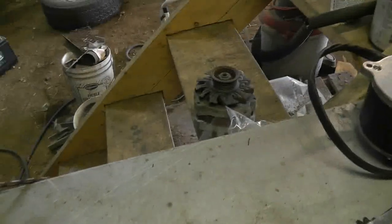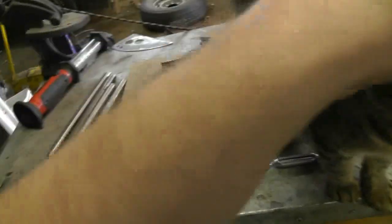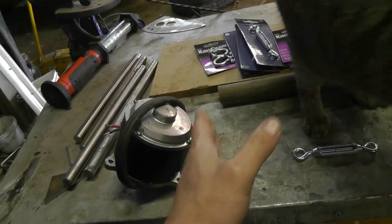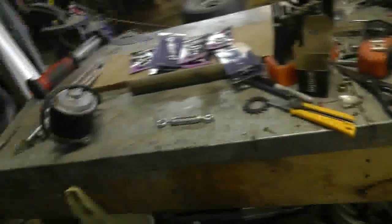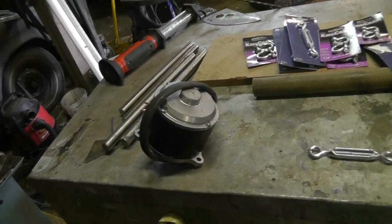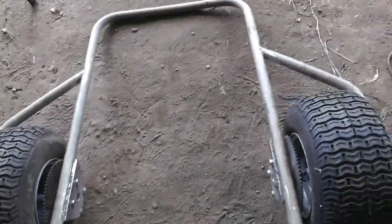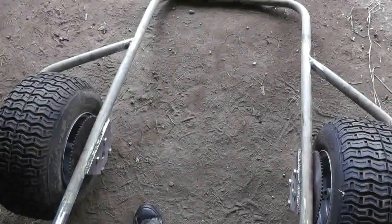A lot like the way an alternator is typically mounted. That will keep it from twisting, and then I can just use the turnbuckles to the frame. But in order for that to work, I need a second mounting point to weld to on the frame. I might use a piece of quarter-inch plate for the pivot on this side. I think I'm going to have to make a kind of cross member here — either a straight piece, which would work perfectly well, or with extra bracing. I'll work out how I'm going to mount the motors first and then worry about that next.